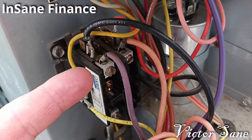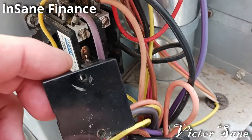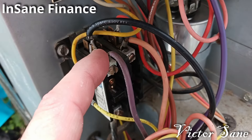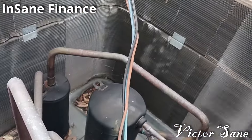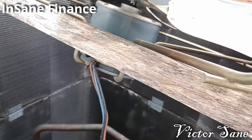This time I had taken my voltmeter and checked for voltage going into the contactor and out of the contactor, because it had this little cover on it. I couldn't just push the thing, so I checked with my meter and I saw I had power coming out both sides for the compressor, under the proper conditions of course, but the compressor was still not running. So I was afraid the compressor was dead — but why would the compressor be dead and the fan be dead at exactly the same time?